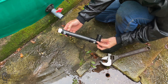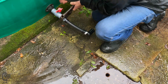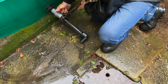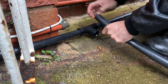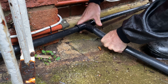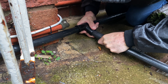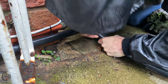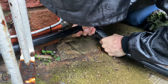This green tank is one of the existing tanks — it's quite full of water already but I still wanted to replace some of the pipes and fittings. I ended up screwing some new fittings on there, remembering to apply thread tape and tightening up — not too tight to split or strip any threads, but just enough so that it wouldn't leak. The last bit of the installation is to connect the existing green rainwater tank's new outlet pipe into the bottom of our T piece. Once this is connected, basically everything is done and we can open up the ball valves, start letting the water equalize between all three tanks, and start catching new rainwater.